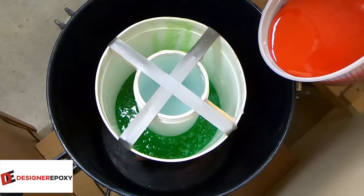And anyway, there were a couple of bumps in the road here. The transition from the burl upwards to the top of the vase was very tough to deal with. I was getting some chip out and some tear out there. But for the most part, the turning on this piece on the inside went fairly easy. The only thing that was kind of irritating was, of course, you're getting a lot of resin shavings. So if you've got wood and resin combinations, typically those resin shavings will not break apart, and they're going to stay together and clog up the inside of the vase and wrap around the tool. But that's what I was dealing with up near the top of this anyway.